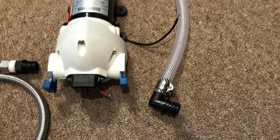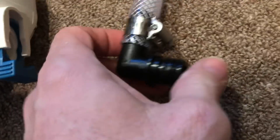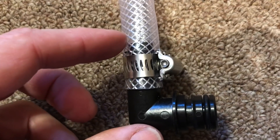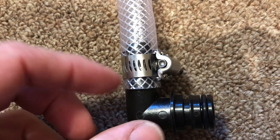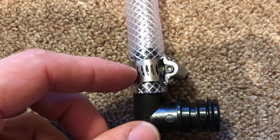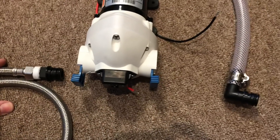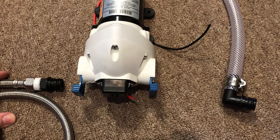Now that the tubing is out of its warm bath it's much more relaxed. When you put the tubing on, push it all the way up to the end and put the clamp in the middle — don't put the clamp all the way at the top or bottom, try to get it right in the middle. Since this isn't going to be pressurized, tightness isn't as big a factor.